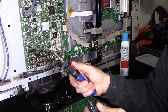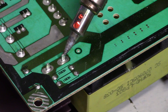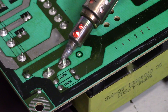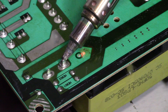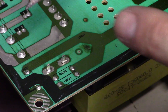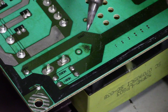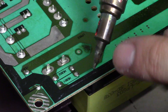I'm going to show you how to solder. I'm going to move it to the middle setting and click that on. So what you want to do is heat it up. You want to hold the soldering iron vertically so it doesn't scorch the board. If you hold it down like this, it will actually scorch the board — you don't want that. There's no trace right there, but there are vent holes. Whenever you see a vent hole, you want to face that upward so it doesn't scorch the board. That's kind of like a heat shield on the other side — no vent holes on that side, but a vent hole on this side. You want to aim that upward.